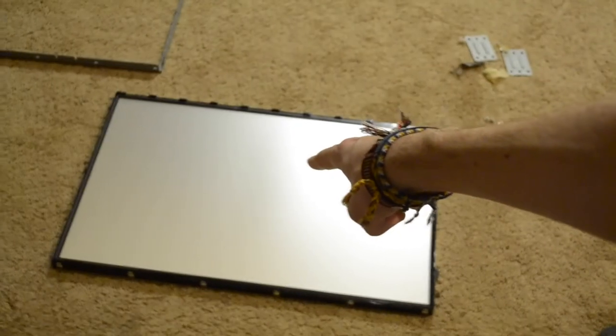Now separate the plastic guard from the metal backplate to reveal the inner workings of the backlight. You need to be careful with this layer because it can and will break — unclip each buckle one at a time. After you do this, the diffusion layers will come off. Put these to the side with the matte side down and make sure that no dust or little particles get on them. Under the diffusers you'll see a large plexiglass panel with some kind of honeycomb or lattice pattern on it — this just helps the light spread evenly across the panel and it should come right out of the backplate. Take off any copper tape you see. There's a white plastic layer behind the plexiglass; usually it's held in place by the metal brackets — I find it best to leave it attached as best you can. Now you need to very carefully remove those metal brackets from the top and bottom of your soon-to-be light panel; you need these to stay in the same shape so be very careful not to bend them at all. You'll see those tiny fluorescent tubes — we need to take these out and replace them with those LED strips, and now you'll see why they have to be so thin.